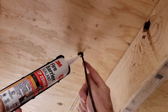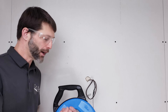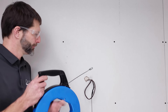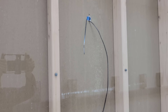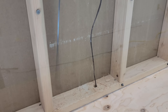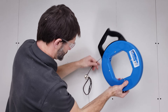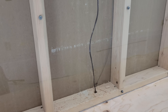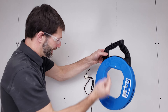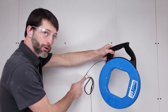Sealing also ensures you don't have low-temperature air from the crawl space coming up to the thermostat or musty smell from a wet crawl space. I want to show why we don't fish from the wall hole down to the hole in the subfloor — it's very hit or miss. As you can see it's kind of the luck of the draw, which is why it's a lot better and easier to just fish it upward into the hole and then grab it with the coat hanger.